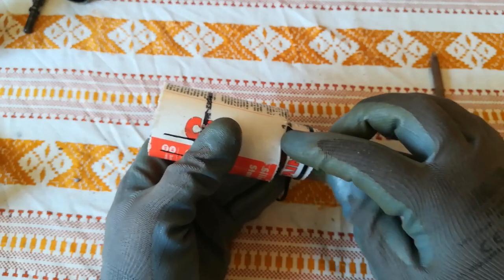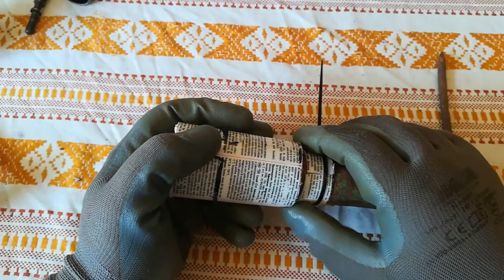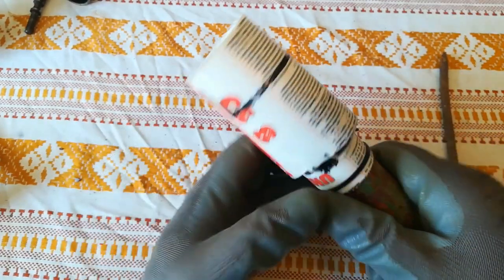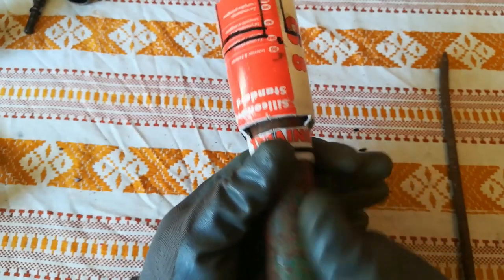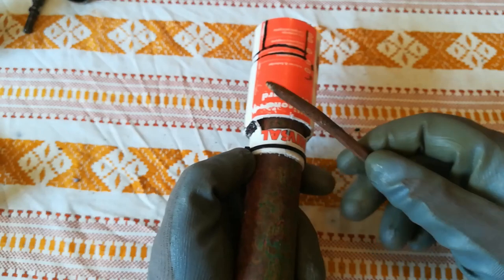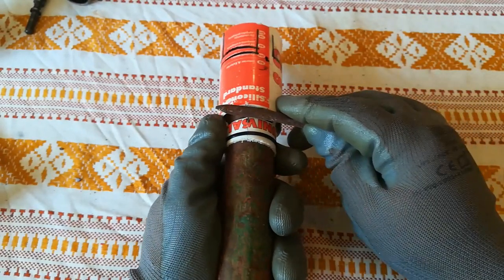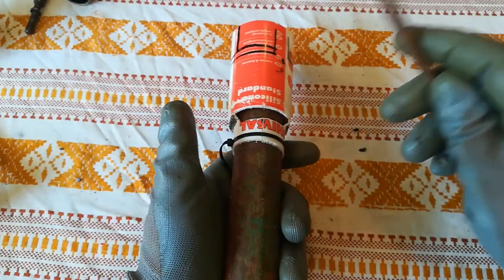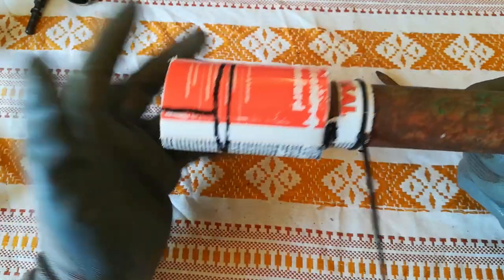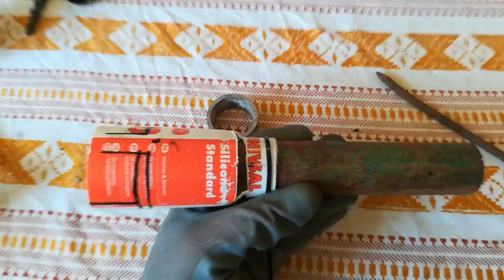Make this maybe a little bit wider just to be sure. When you hit this piece here, or if you clamp it in a big vice — I have a blacksmith's big vice — that's how it looks. When you need to seal these gaps, all you have to do is bend this nail around this pipe and just weld it. That's how I did it and it works just fine.